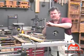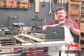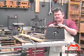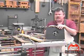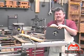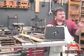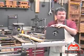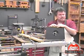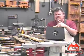You have to think about how the wood is going to slide. Obviously those laminations, when you put pressure on them, they're going to slide and they're going to adjust. So you have to work either from the middle out or from one end over. Otherwise they won't be able to slide. But in some cases, if you work from one end towards the other end, by the time you get to that end, you're going to find they've slid so much that the end isn't useful anymore. You don't have enough stock there. In that case, you need to start in the middle, or start at some place where when you get to the ends, you're going to have everything you need.